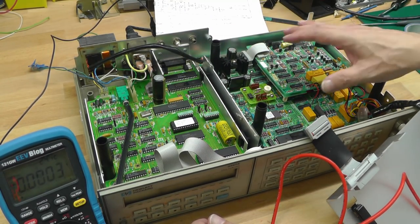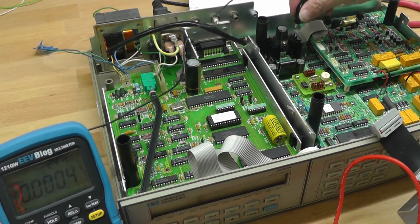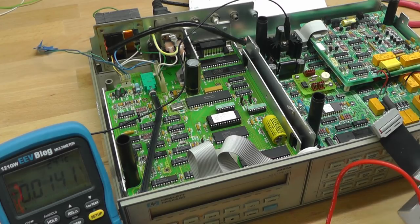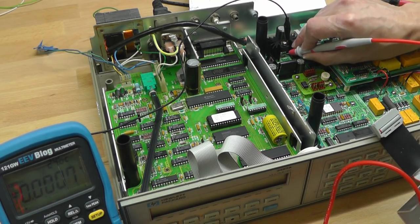That's the only regulator on that board there in regards to the power supply, so I can move across to the other side. It's got an isolated supply, so I need to remove the ground, and I'll just go across the 5 volt regulator here, which is the 0 volts, and still got power on. And then this is the input to that regulator there,